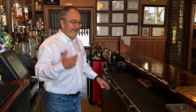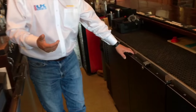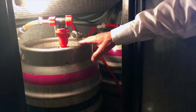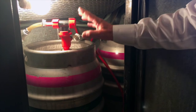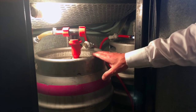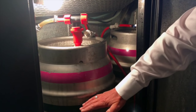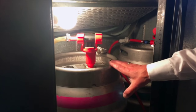I'll show you that. There is a video on the site all about the cask wedge, but you can see basically how it works here. The cask wedge system enables you to dispense the cask in an upright position. There's a tube with a float that, as the beer level decreases, the float follows it down. It works very well and obviously takes up less space.